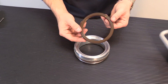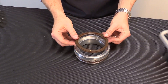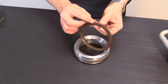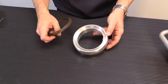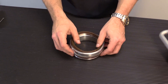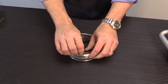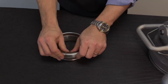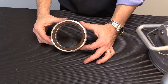When replacing the FKM-B nose seal, look for the yellow painted dot — this will be the face-up side of the seal. If you flip the seal over, you'll notice a step in the seal; this step fits into the groove on the nose piece. Simply push in and press down. If the seal is not put in place properly, it can be washed out during service. Double check your gasket to make sure it's seated properly, and now it's ready to be put back in service.